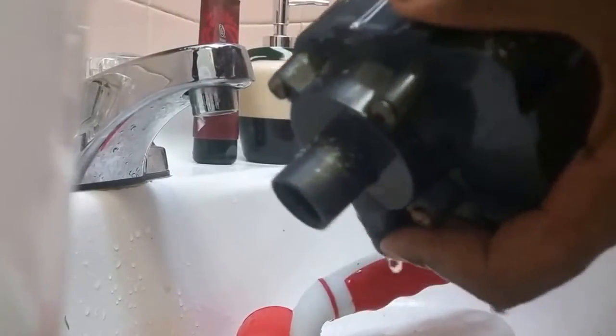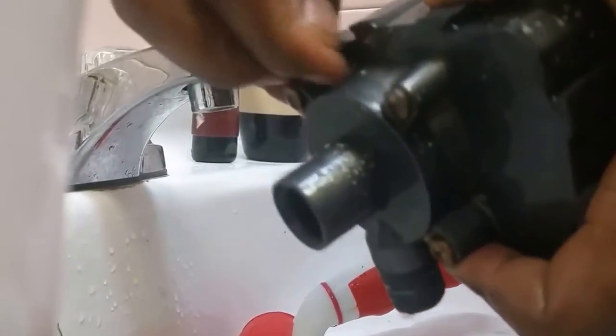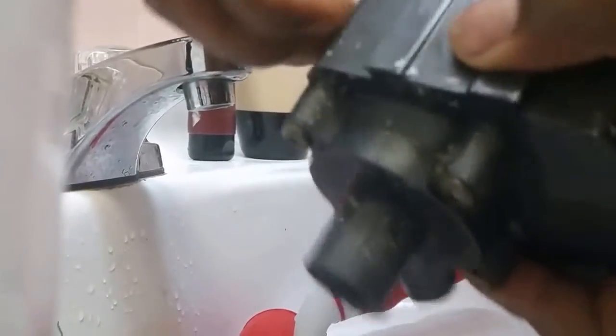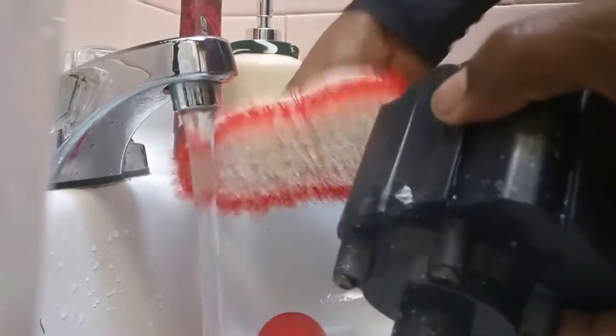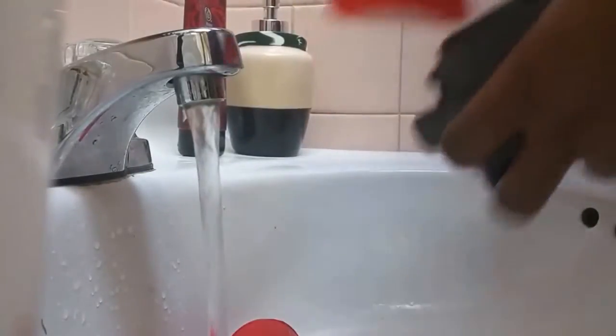You can see, even scrubbing, you got barnacles and things that are really hard to get off. I use my fingernails, but those aren't a big thing. But imagine if they're on your impellers, they can greatly reduce the effective flow rate of your impellers. That's why I have a hard brush to scrub that off. There we go. Nice. All right. So now let's fast forward and take a look at the pump in action now that it's nice and clean.